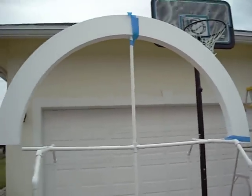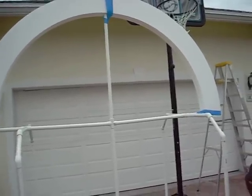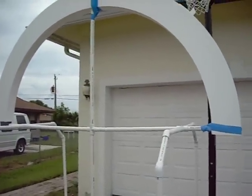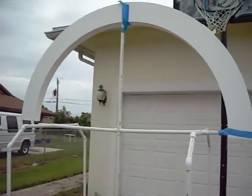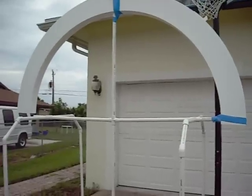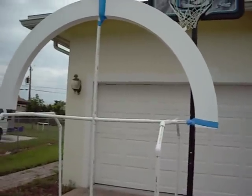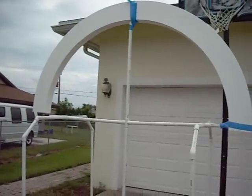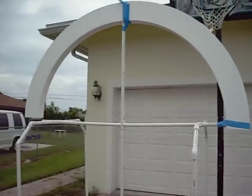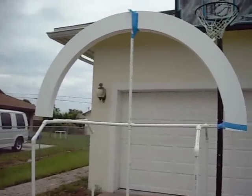I think this is going to be the best loop I've ever produced. I won't need to run an antenna wire or ground — it will be double-tuned. The main loop is essentially a large tuned signal-capturing circuit for pre-selection. You can get 30 kilohertz selectivity on the outer loop, which acts as your antenna-ground, and with a double-tuned arrangement it becomes much easier to shave that down to 10 kilohertz selectivity and below.